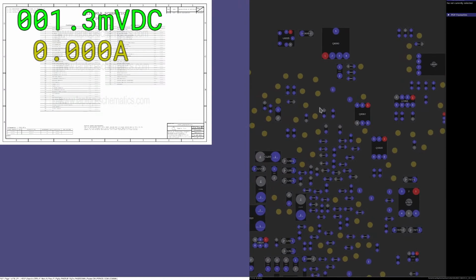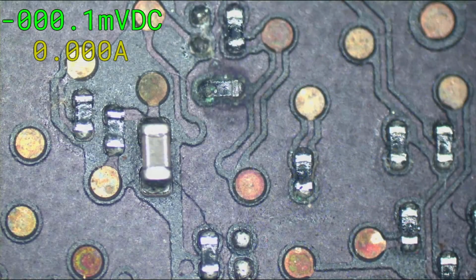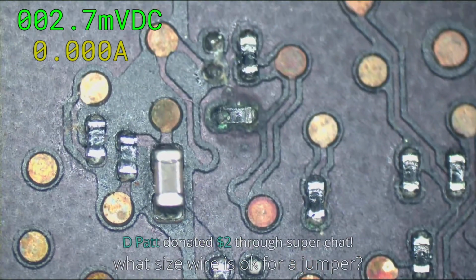Is this what I'm looking at? Yeah. This guy is a strap resistor for EDP backlight enable. Look at that. So this is another thing that can cause no backlight like our last one. This one little thing right here, if this looks terrible when you look at it, this right here can cause no backlight.